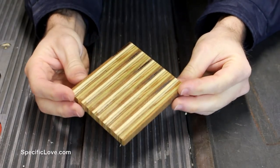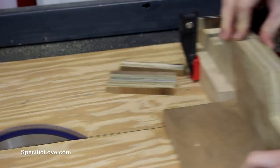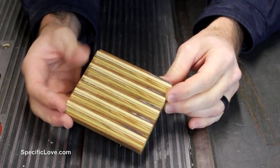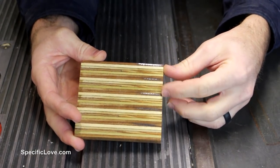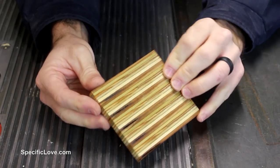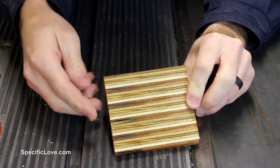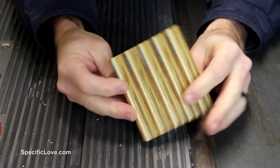Here's an example of what not to do. I used an old piece of plywood that had an oil stain in it, and I did not realize the oil stain had actually penetrated all the way through the wood. I chopped it all up and glued them together, and what I thought was a burn stain is actually oil infused into the wood. The urethane over one part is fully dried, but over the oil-stained area it's still sticky. So if you're using old plywood, make sure it doesn't have any type of oil or residue stain, or it could ruin the process.